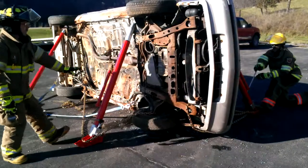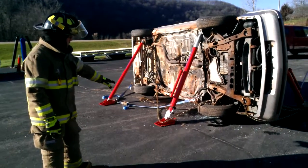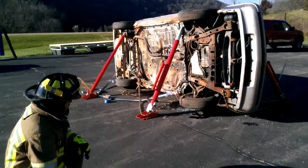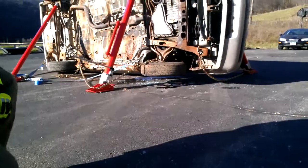And because this does go relatively fast, your partner can feel and see what the other person's doing. We'll stop there. We'll walk away. This particular setup, you can see we're not going to get a huge lift out of it because I'm starting to put tension on the chains and on the base. But if you look down, you can see we're at least a few inches off the ground — potentially enough to get your trapped victim out from underneath.